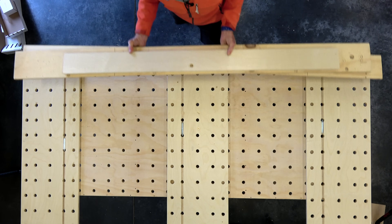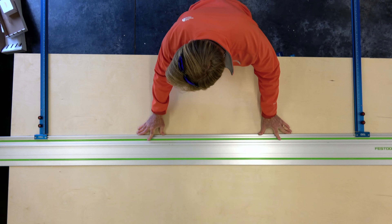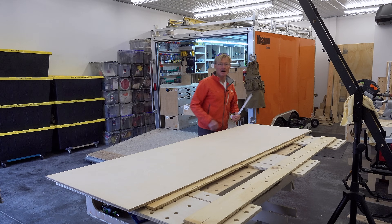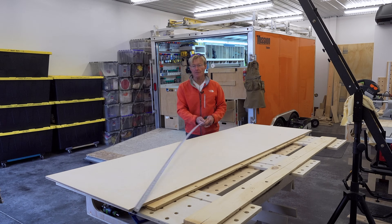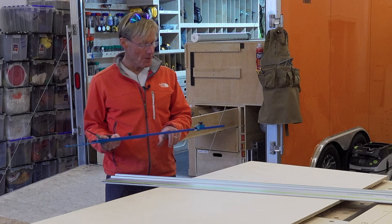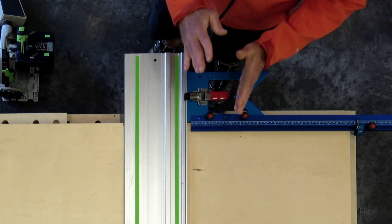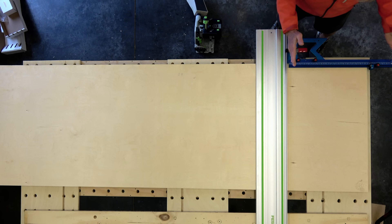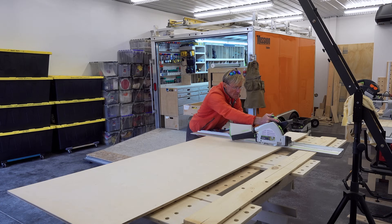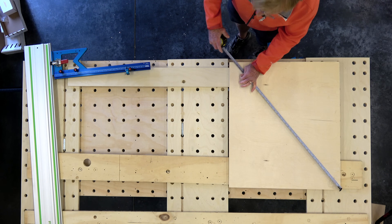Let's make a cut. I'm measuring 761 and 2568 on the parallel guide. Now I need a 663 crosscut, so I've attached the 30 inch rail to the guide rail square. In this case I'm using the guide rail square to square my track and the 30 inch rail to give me the length of my cut — setting it to 663 and 1008.